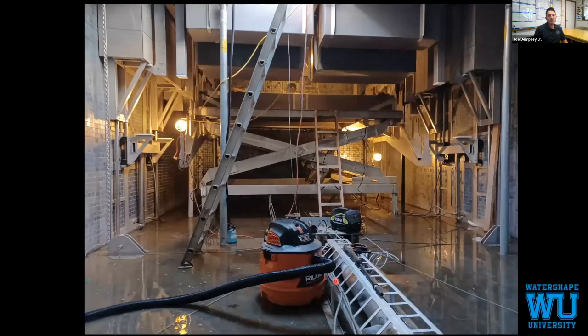Underneath the pool, you can see the cage over the hydraulic ram going over to the pulleys. Pulleys divert over to the vertical pulleys, which go up to pull the floor down. We have jacks in right now to support the floor while they're working on it. And then the chains, as they gain tension, will push the locking pin into place and lock it into place at the maximum height.